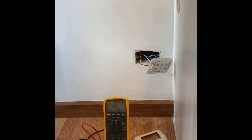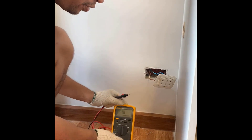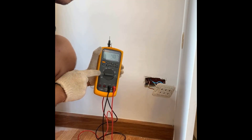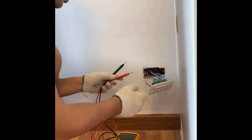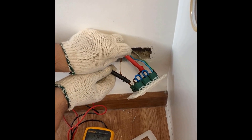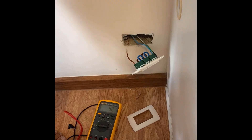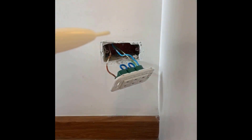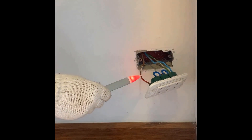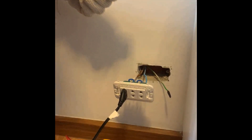The next thing I'm going to do is turn the breaker back on. Now I'm going to use my multimeter to test the voltage — turn it to measure alternating voltage, and be very careful when you work on this. Stick one probe into the live socket — it reads 230 volts. You can also test using a contactless voltage detector; move the tip of the device closer to the live wire and you'll hear it beep. This is the live wire and that's the neutral.